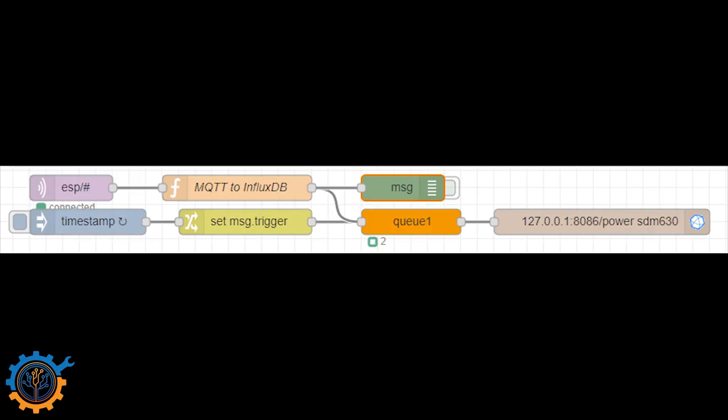In Node-RED, I have this queue, or this flow, as you can see above. The flow itself is rather simple, where it takes all that comes in from the meter itself and then parses it and then sends it to the queue before it actually goes to InfluxDB. The queue is there to handle when we have issues with Influx or when you get a lot of data. If you process, like I do, 4 meters at the same time with a bunch of data, Influx won't be able to handle it unless you have installed a queue in front of it. So that's why I'm adding it in Node-RED.